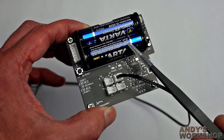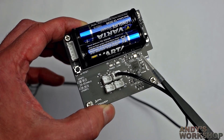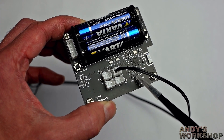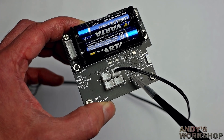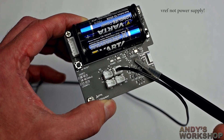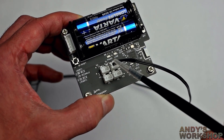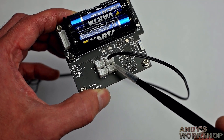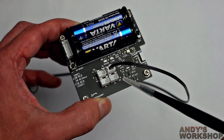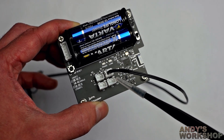Given two fully charged AAs, you're looking at a range of 3.2 volts, which will steadily decay down to a practical limit of around 1.8 volts, because down here I've got a 1.8 volt reference by Microchip. I'm using that to supply the power for the ADC on board the WB55, which does the conversion of the temperature readings coming in here. These are temperature sockets — I've got NTC thermistors going into these sockets and they go through a resistive divider into the WB55. I use the 1.8 volt voltage reference to convert the voltage to a temperature reading using the well-known standard formulas.